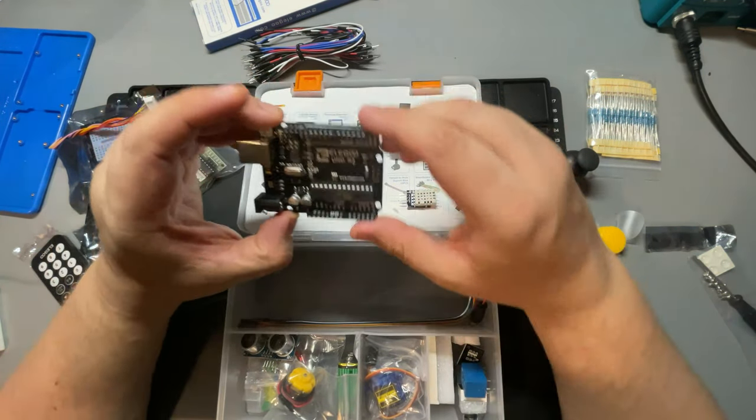we'll get good at these schematics. Okay, so we've got a 220 ohm resistor off pin 3, 5 and 6. And that'll go to the different LEDs. Okay. Yes, there must be some code, surely. So we plug the LED into 4 of the lines. Obviously, there'll be the cathode. I think it said that the cathode is the longest one on here, which is confusing because normally the longest is the positive, but never mind. 220 ohm resistors, and they're going to 6, 5 and 3 RGB. Okay, yep, we can remember that.